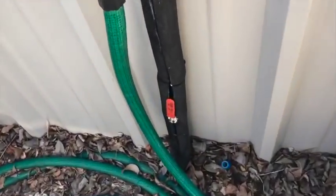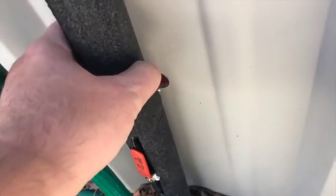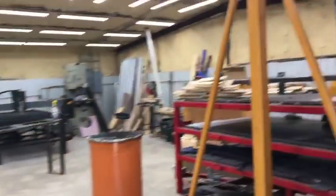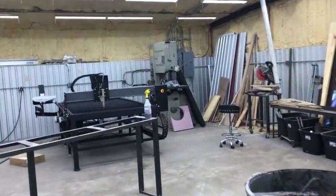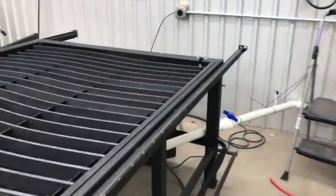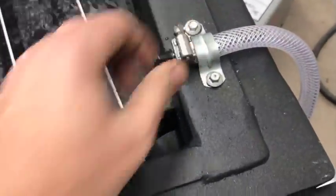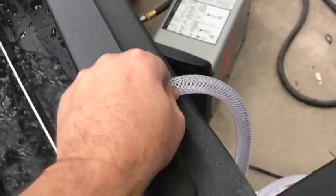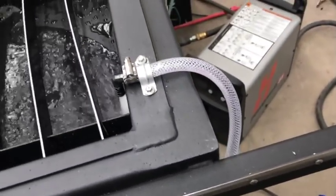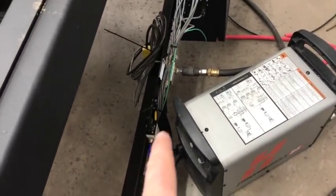I tapped into the water line right here and added a valve to turn it all on and off - you can see where it goes in right there. I'll seal all that up. My thought was to keep it off when I'm not using it so there's no water active in that PEX at all times. If something were to happen, there's no water in it - I only turn it on when I'm filling the table. I used some stuff I had on hand - this flexible stuff here is rated to 200 PSI for the last little bit of the run.